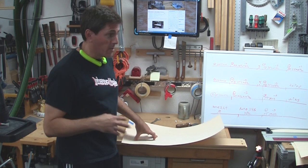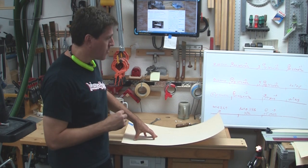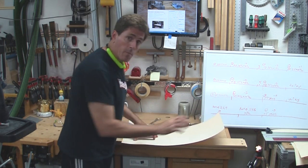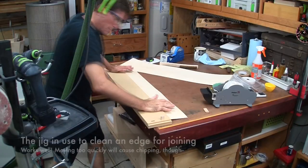Now we're going to have to try this on the burl separately, although the burl's been flattened and softened with the veneer softener and such, so it's a little bit toughened up on the edges. And we can always use some veneer tape on an edge. Put a little bit of the paper veneer tape on there, then put this down, and it'll greatly strengthen it to make a clean cut.